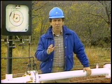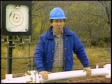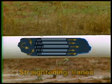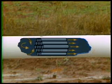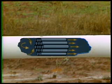The length of the straight pipe should allow for the maximum beta ratio which may be used. Sometimes due to space limitations, straightening vanes will be installed to reduce the amount of straight pipe required upstream of the orifice plate. Straightening vanes are used to eliminate swirls or cross currents caused by pipe fittings and valves upstream of the meter tube. They are usually made from either standard weight pipe or thin wall tubing.